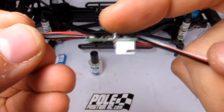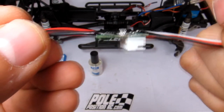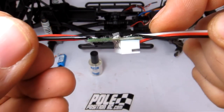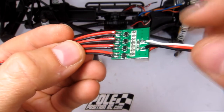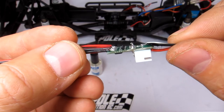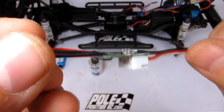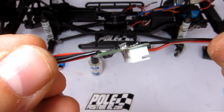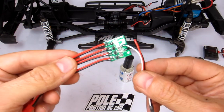You can see how nice and shiny that is already. A quick note: if you have a board where pins stick right out, those will probably catch on something and the coating will wear away. So clip those down with a pair of wire cutters before you apply the coating. Then put the coating on top and wrap it in electrical tape, duct tape, or gaffer tape to make sure those exposed areas don't wear down and cause a short.